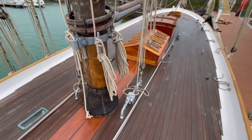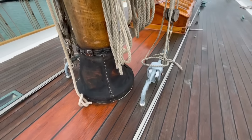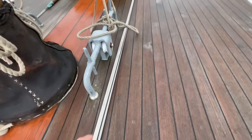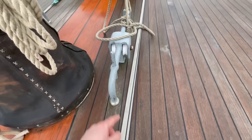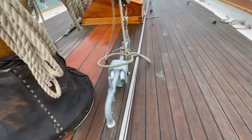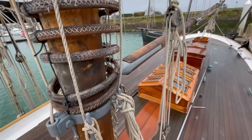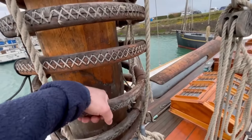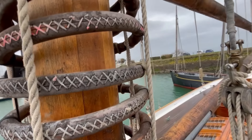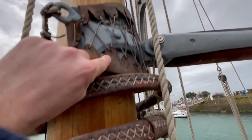Here's the mast — the mast was new several years ago. Leather boot here, mast gaiter boot. These are the rails on the side; they're actually stainless steel, made new and then painted in a grey paint so they don't look like modern stainless and they do fit in with the pattern of the boat. Mast hoops are ash and then leathered — see the nice stitching here. And the gaff saddle is fabricated and then leathered.